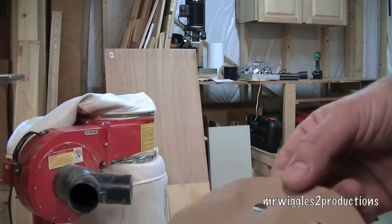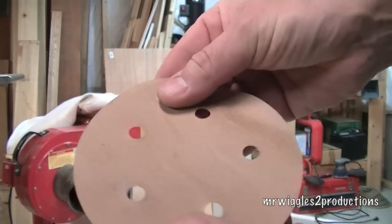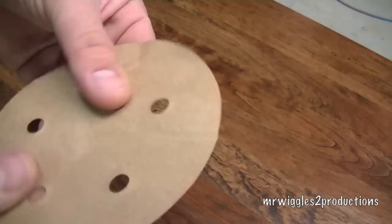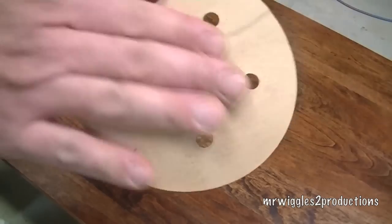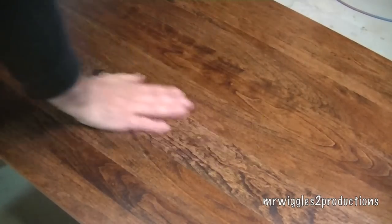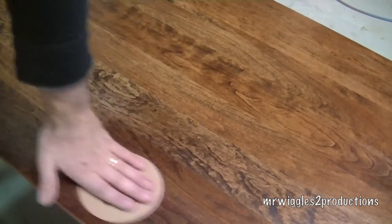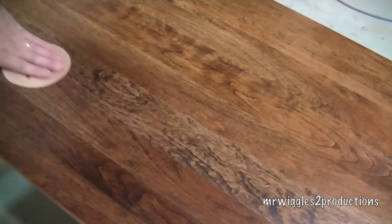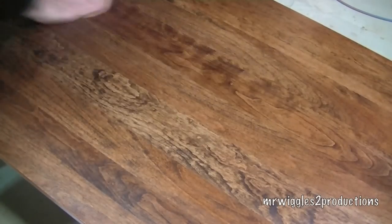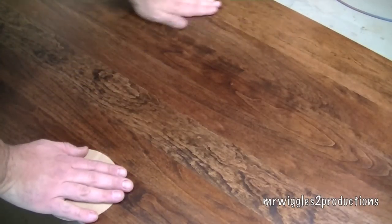Here's a tip: in the pad sander kits, if you get the round ones, you'll get spacers — these are just made out of paper. I will use these for the final sanding; they work really well. You could also use a paper bag, which works very well for final sanding — it's just rough enough that it puts a baby-smooth finish on. After your second coat, all it's doing is burnishing the edges of the finish, so it's not really creating much dust at all. You can hear how rough that is, and when I rub it you can noticeably tell the difference.